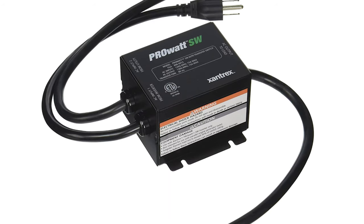In general, and this sounds crazy if you're just getting started, you may not understand that you can't plug certain things into appliances when you're boondocking somewhere in a Walmart parking lot or out in beautiful Sedona. That's because you're running off of your battery power and it's wired differently in some cases than your shore power. But there is a way — a little spoiler alert — so that all of your electrical appliances can plug into the same outlets, and whether you're running from shore power with 110 or running DC off your batteries, you can use the outlets the same. We didn't know about that for two years of our journey.